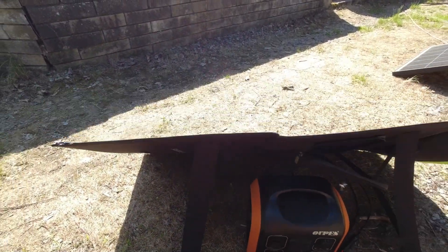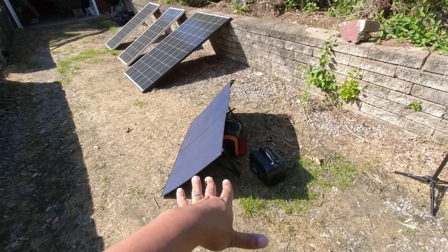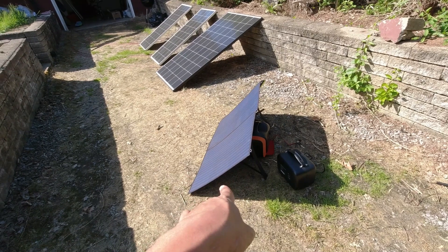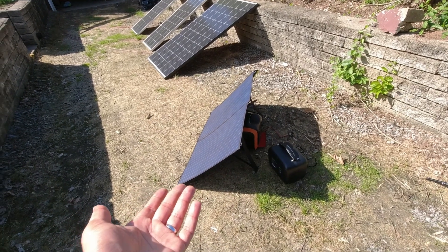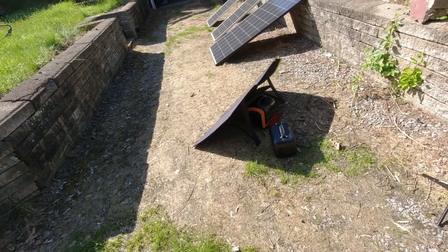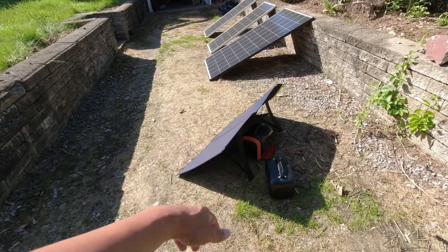To give some perspective on how I look at these folding panels: this thing is getting 60 watts, we've seen 63, 64, and at least 70. I like the idea of dealing with a budget panel when that budget panel costs around $2 per watt for actual output instead of advertised output. At $1.50 to $1.70 or even less, you're pretty much getting $2 per watt for real watts. Depending on where you are, you could get more — I'd assume this panel will do about 80 watts, which is typical for 100 watt panels.